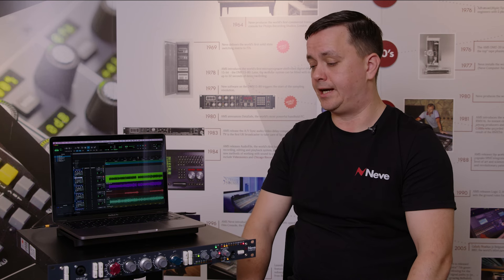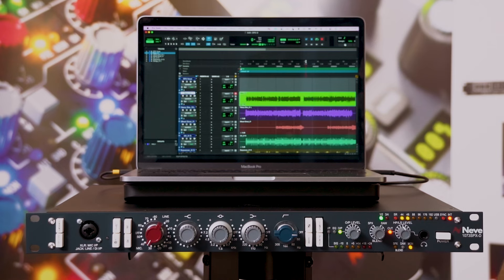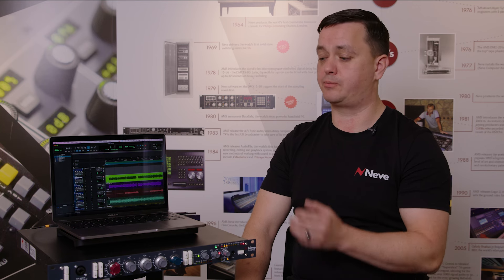There are multiple potential uses. Some beta testers even used this as part of a live sound setup — a vocalist side of stage plugs their mic in, uses the headphone out to feed in-ear monitors with a cue feed from front of house, and sends the 1073 output signal back up to the front of house desk for really high quality vocal processing in a live context.